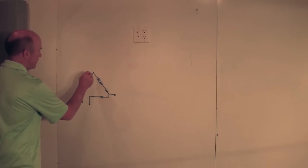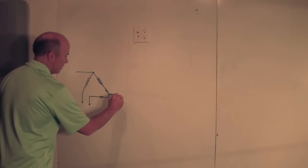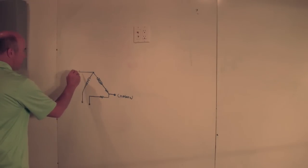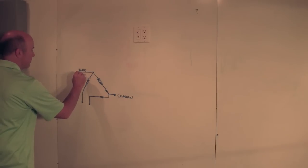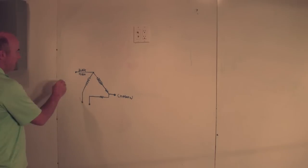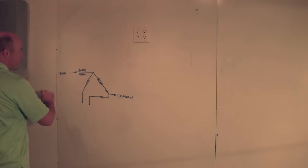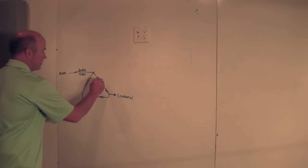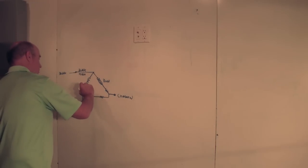So basically, there's a wire over here. If I make this a common to a 120 volt circuit, and this is typically a black wire, high speed, and I hook this to the other power, say the black wire from your house or your 110 supply, it spins the motor. However, this is a run winding. This is a start. I'm just going to write it right here: start.